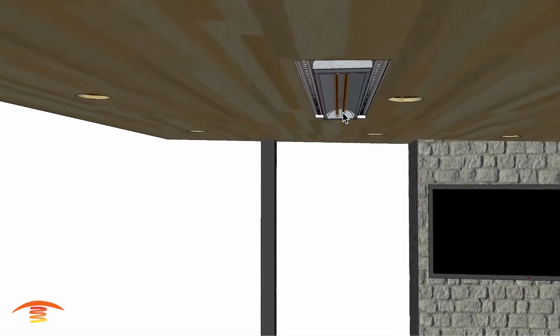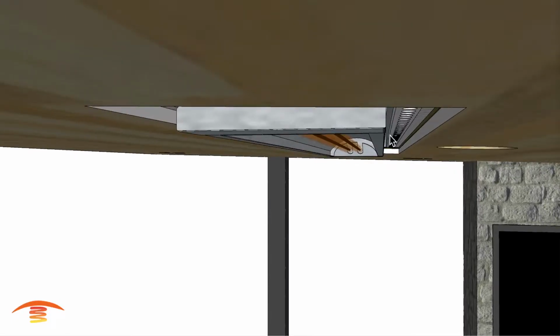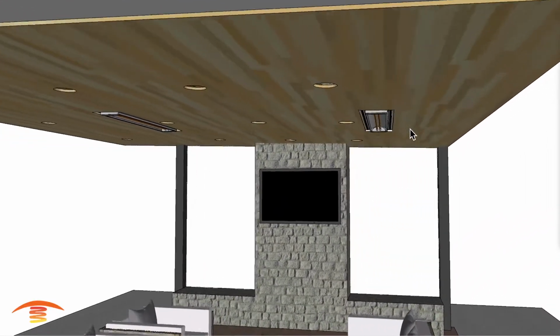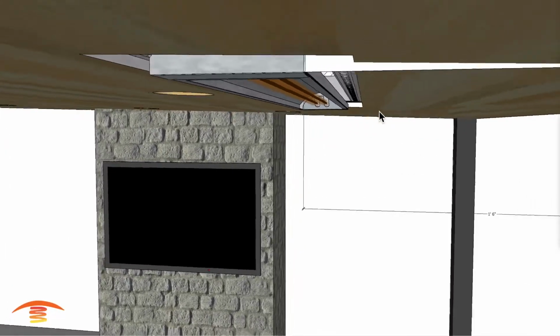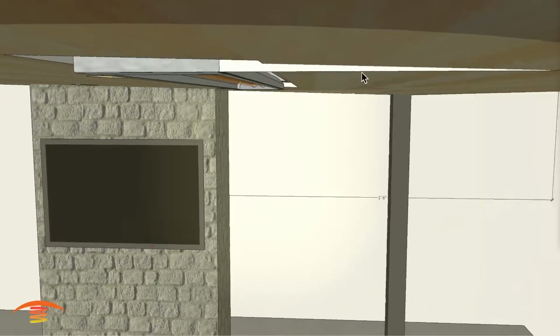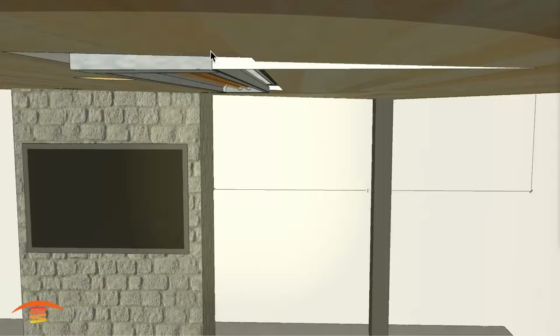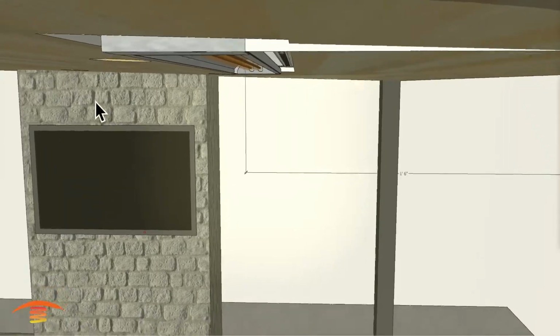So I'm not quite sure how to make that kind of suggestion. And the other thing is because this is a combustible ceiling, the heater needs to be at a minimum of the elevation, the bottom elevation of the ceiling. I'm going to show you how I did this over here. I'm going to put the dimensions back on here for a minute, but you can see that it needs to be 18 inches all the way down. So if you looked at the clearance below the heater, you can see that it's 18 inches out to this edge here. So that's where that heater needs to be, so that it's down far enough so that it meets 18 inches all the way to the edge of the slope, as well as being, again,